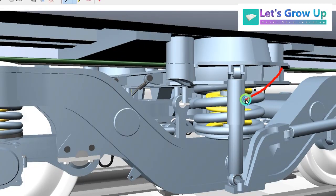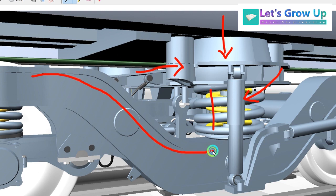So at first here you can see the Vertical Damper, also called the Shock Absorber. That means different types of shocks on the Coach Body. Every coach body has weight; the weight is transferred to the suspension — here you can see the suspension — by the bolster. The load is transferred to the suspension and then to the bogie frame, then primary suspension, then axle and wheels. So there are so many processes to transfer the load. If there is load, there is obviously irregularity — that means there is jerking.